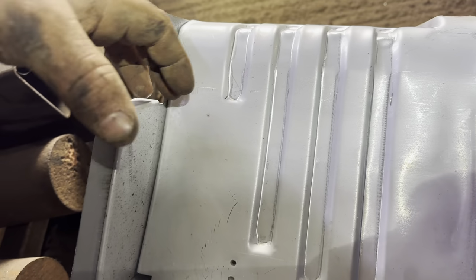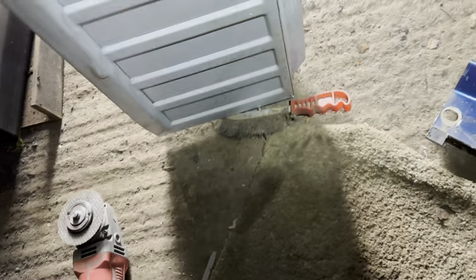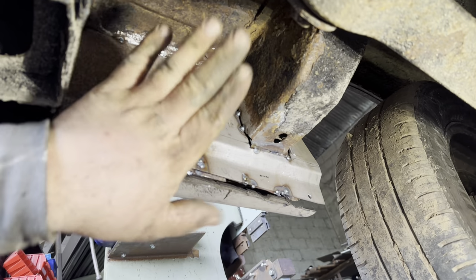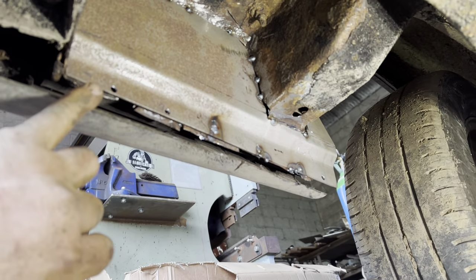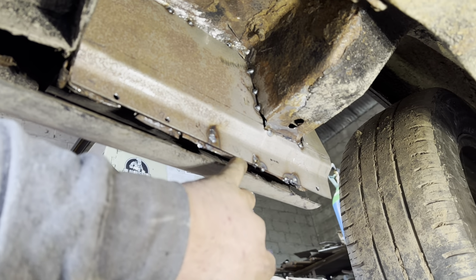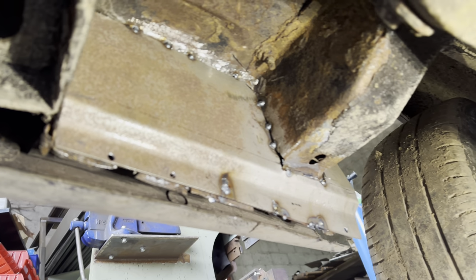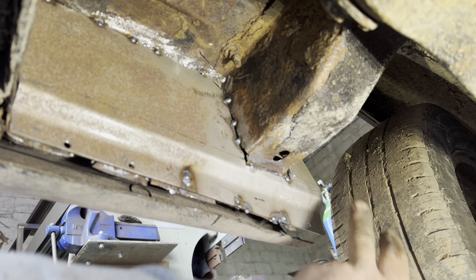And then obviously all the outrigger and that all goes around there, so you won't see any of that. So the only bit you'll see it's welded in is one line across there, which I think is a good idea, don't you, Elliot? So that's that panel all in. It just wants a few more spot welds along this edge, just where we can get some, and then round that edge off down there.